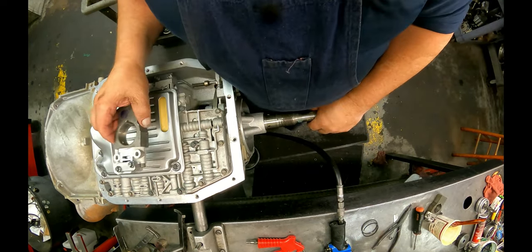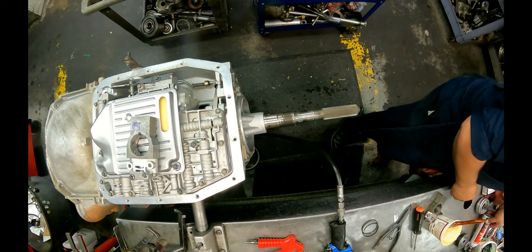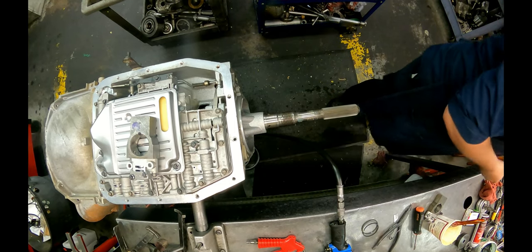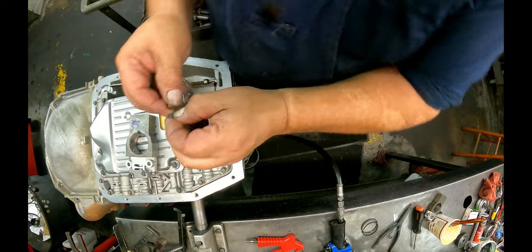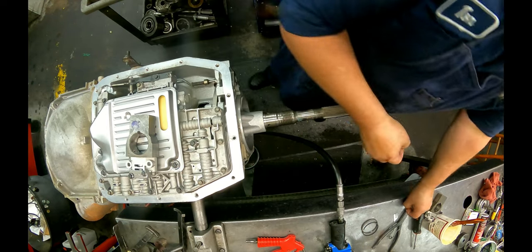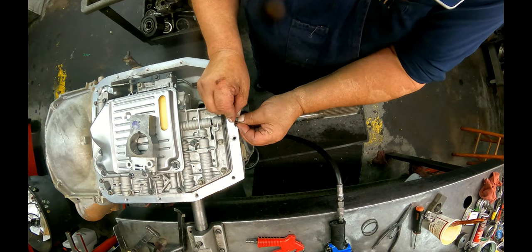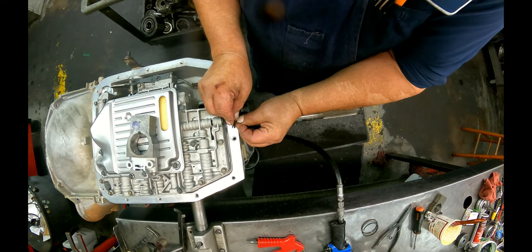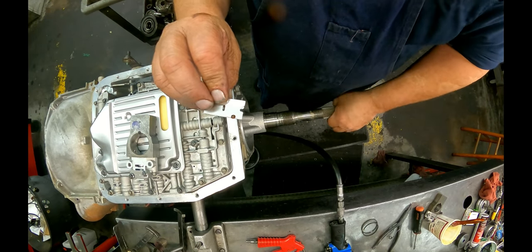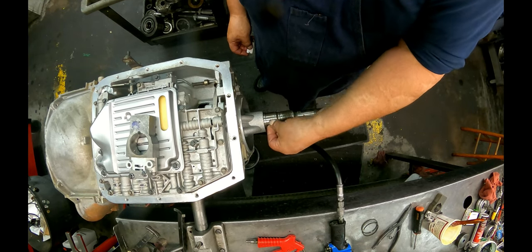All right, this governor usually fits really loose. So, check balls go. Find you a rubber ball. It's pretty squishy. Usually use this orange one. And you want to shave just a little bit of this off. You don't want to get too much, but you don't want to get too little. All right, that's probably enough right there. I'm going to turn this up. You want the rounded end down if you can get it, if you have it.